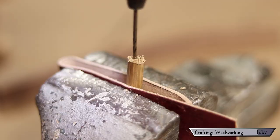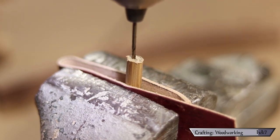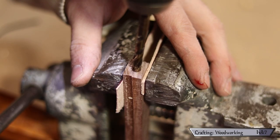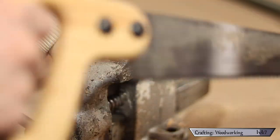You stick a pipe bowl and the stem together using a mortise and tenon. For my tenon I'm going to be using this leftover piece of quarter-inch oak dowel from my arrow project. Using a 3/32-inch drill bit I carefully drill a hole into the center of my dowel, then slowly increasing in drill bit size I carefully drill in my mortise in both the stem and the bowl. Then I cut my tenon to size and stick it into place.